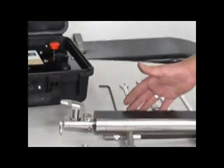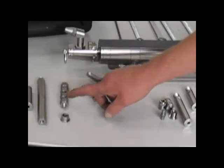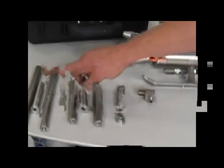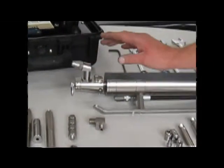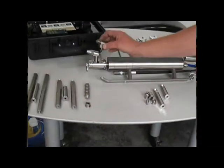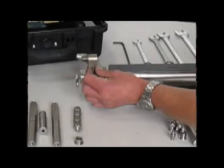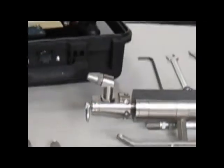This is currently set up for a 6-inch configuration, and we have legs and nozzle adjusters available for 4-inch, 9-inch, and 12-inch setups. The cutting head is currently positioned at 15 degrees, which is set up mainly for root removal. We also have a 90-degree head which can be fixed into position, allowing you to cut intruding connections out of the pipe.